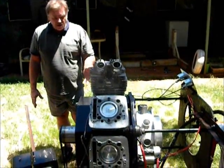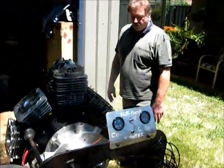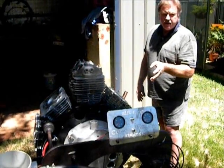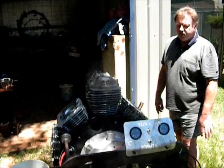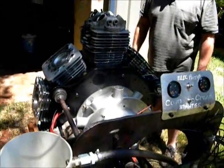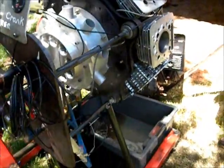It's difficult to modify, but I can make this change. We'll come back at a later date, hopefully not too far off, and check it again to see if we've got the result we want. The main thing is we are getting pressure at higher RPM. Yesterday we got enough oil up to the cams, but we had way too much crank pressure — up around 85 psi, which is too high. One good thing about the leakage is that it sprays out all over the gear case, which is very good for lubricating all the drive gears for the cams. So once I modify the oil pump intake, I think we'll get a good result.